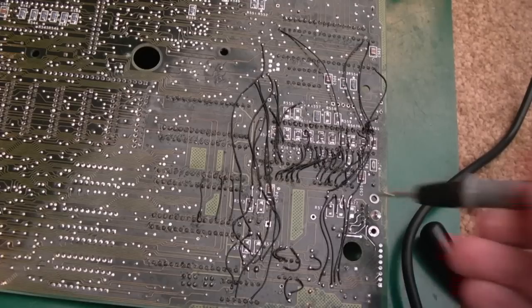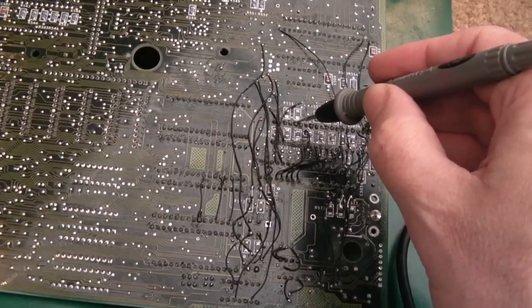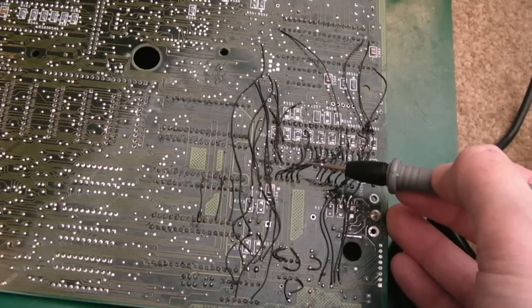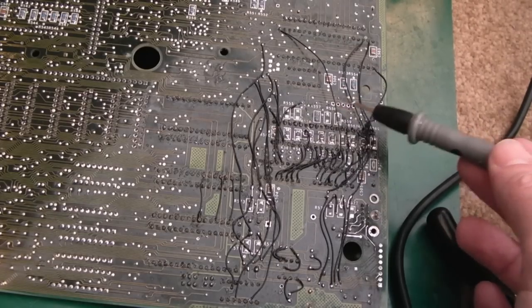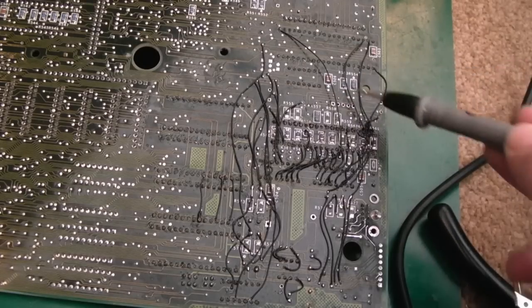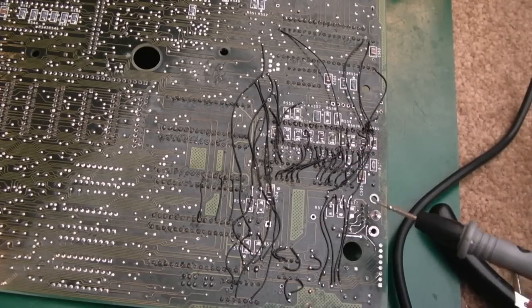There's a reason for that. Say, for instance, you solder them dead taut, nice and tight between points, then come to solder another point, either a wire or a pin next to a wire, and the wire is leading over the points you need to solder. So there is mileage in leaving a bit of flexibility. You can move these out of the way of where you need to solder, so you do need little bends and curls and twists to give a bit of flexibility for adjustments.